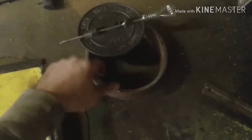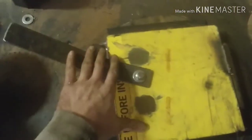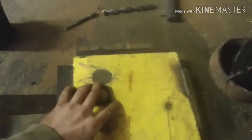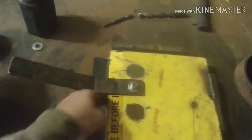I like to weld in little stops inside here so you can only quarter turn it — so it hits a stop at the bottom of the flue, and when you open it, it hits a stop on the other side. For the handle, I blew one hole roughly three eighths of an inch. This door is actually from a block off plate for a Wagner powder coating system I cut up, and these are the assembly bolts. Washers on both sides, a whiz nut — and it doesn't look too bad with the bend I put on it. That will be the handle, keeping it away from the stove so you don't burn your hand. Now I just have to find a little chunk of leftover quarter inch angle iron to weld as my catch.